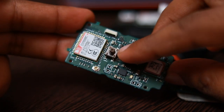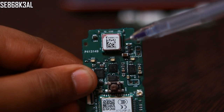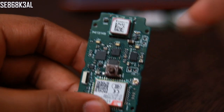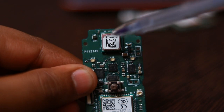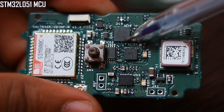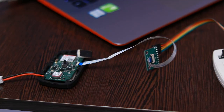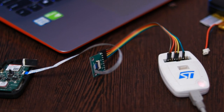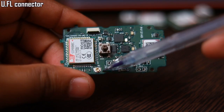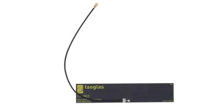I also ordered one more similar footprint tactile switch but it's not so great — it makes a slight clicking sound. The GPS module is the same as in the V2MF design: the SE868K3AL, which has a very thin patch antenna and easily fits inside the enclosure. It's a GNSS module and supports GPS, GLONASS, and a few other country satellite constellations. The microcontroller used is the STM32L051 series MCU and the firmware functions which ran on V2 can also run on this device. For debugging and flashing the MCU, a 10-pin flex connector present on the V2MF design is carried over here. A UFL connector is added for antenna connection, and we'll be using a flex antenna because of its smaller size.